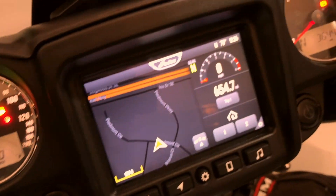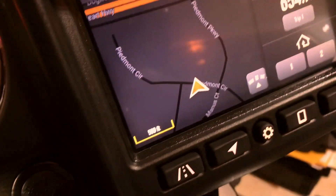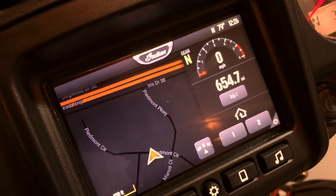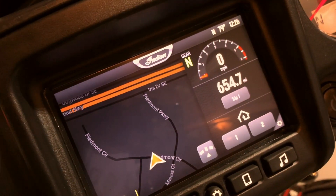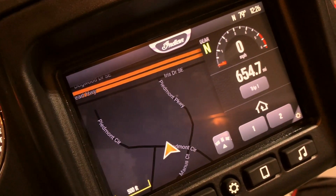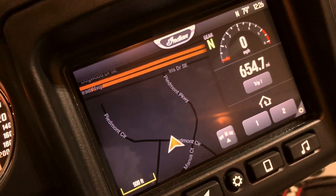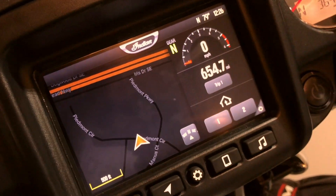It's really that simple. It may vary depending on what kind of garage door opener you have. I have a 2018 Chamberlain with the chainless one — not brand new but not that old either. It pretty much synced automatically. I just pressed the button, it started to flash, I held down the button on my garage door opener until it fully opened or closed, pressed it again to confirm we were linked, and it was linked right up once I plugged it in.